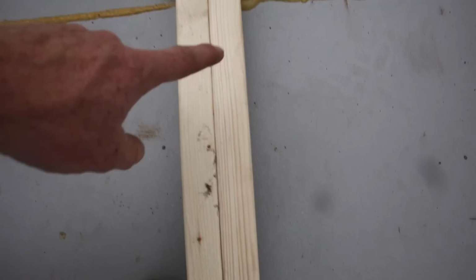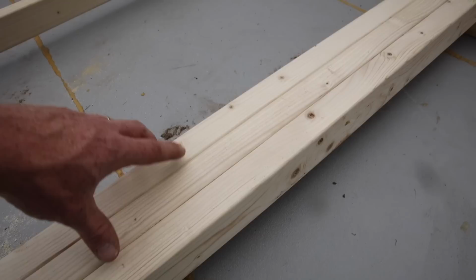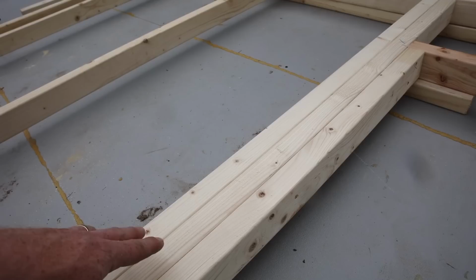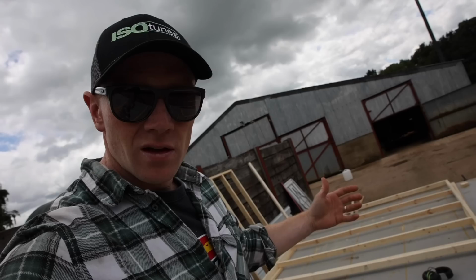So we've got our main stud, and then another stud, a bit like the windows on the outside, just to carry a little bit of weight above the door. Probably not necessary. But the reason we've got three over here is because we've got an internal wall that comes off just inside the door on the right. We'll probably put another stud at 90 degrees here so we can catch the plasterboard, but we need something to anchor the wall that comes off at 90. For now, it's like tracing paper: we just lay everything loose on top of this and transfer all the markings, and bang, bang, bang.